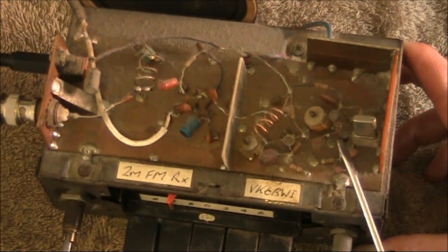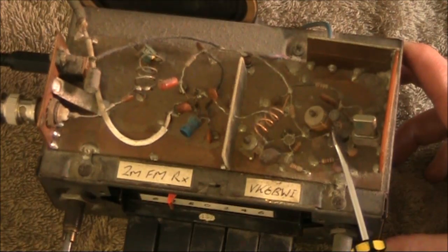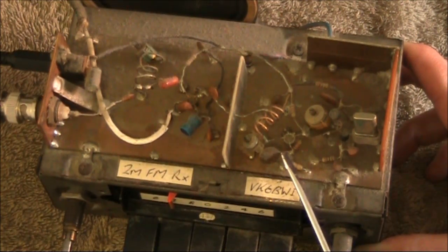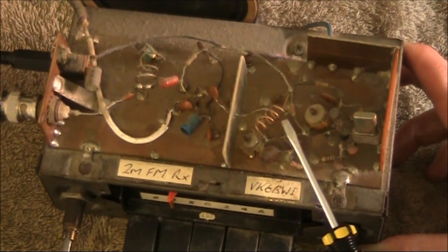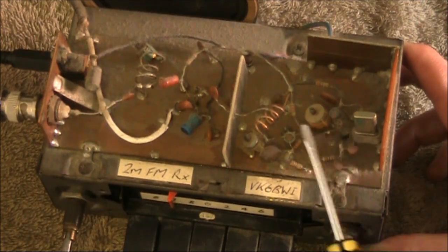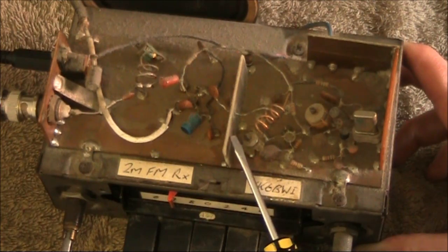The oscillator here is at 18 megahertz. There's a tuned circuit here which taps the second harmonic off at 36 megahertz. Then a frequency multiplier that multiplies the frequency further. This tuned circuit here resonates at about 146 megahertz, so we're actually multiplying the crystal frequency by 8. And then there's a partition.